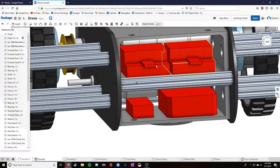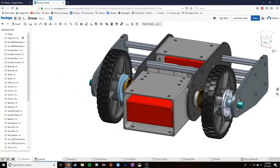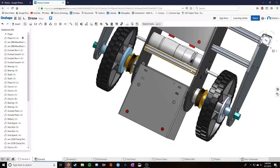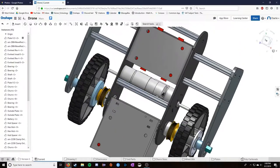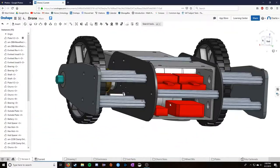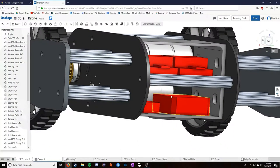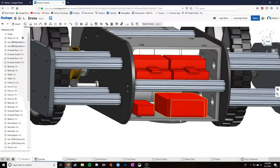So these two up here are motor controllers. This here is an RC receiver. It has a little wire that comes out here and receives RC input. And this is a power converter. So the battery, you saw there was a mess of wires in that video I showed you. The battery here comes up and then around and through here. And then it is routed down below the motor controllers, where it comes in the other side over here of a power converter. That power converter comes out and then powers this and both of these.